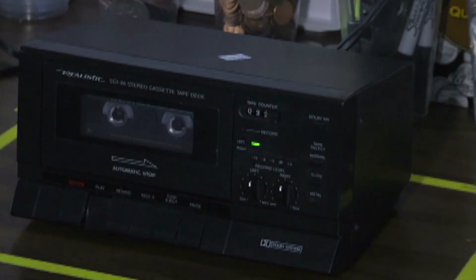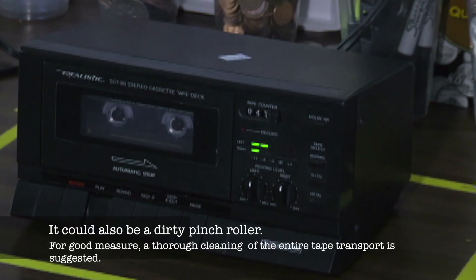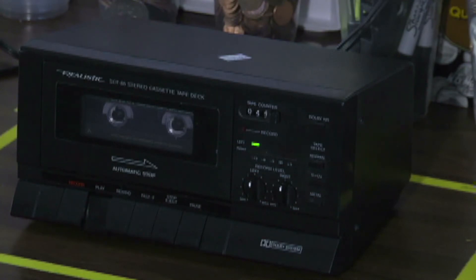This recording is very muffled, and I'm hearing some phase shifting from channel to channel going back and forth. That could be a product of the tape being bad or a dirty record head. I'm going to have to open this unit up, do some looking around, check the heads, check the tape transport paths, clean everything. But obviously something is not quite right with this recorder, and that's probably why I found it at a thrift store.